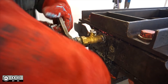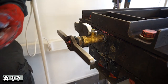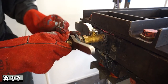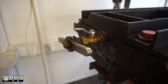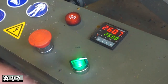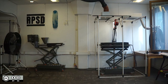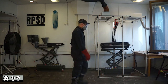Using the quick release handles, unscrew the mould from the nozzle of the extruder. Immediately put a threaded end cap in the nozzle whilst it's still hot. This is to prevent any molten plastic going hard in the thread and blocking it. Once the end cap is in place, you can open the tap again — this makes it easier to clean. Now that they're physically separate, you can turn off both the extruder and the mould using the green switch on the control box. Move the extruder to one side and turn on your cooling fans. With active cooling like this, it takes one hour for the mould to cool. If you leave it to cool without a cooling system, it's going to take 3 or 4 hours, so we highly recommend getting one.